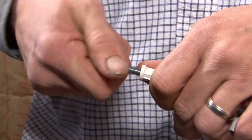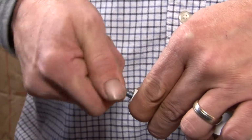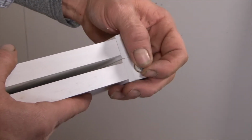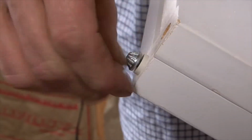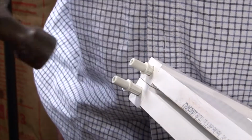Screw the metal knurled hinge pin fully into its plastic sleeve first to prevent damaging the sleeve when tapping with the hammer. Then, insert the entire set into the lower socket of the floor panel, tapping lightly with a hammer to fully seat. Once seated, back out the pin approximately 1/4 inch. Now insert the two plastic top pivots and tap in lightly to fully seat.